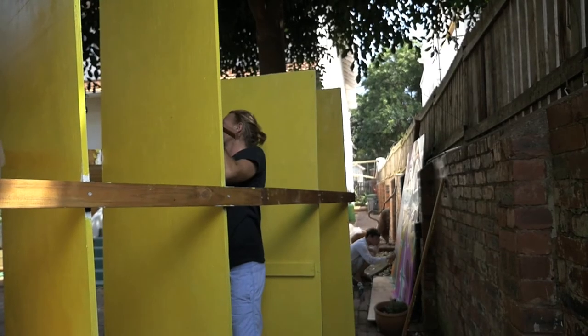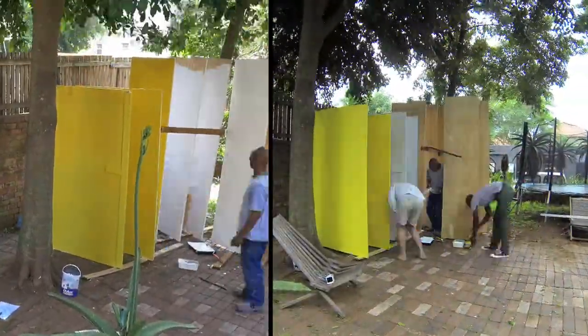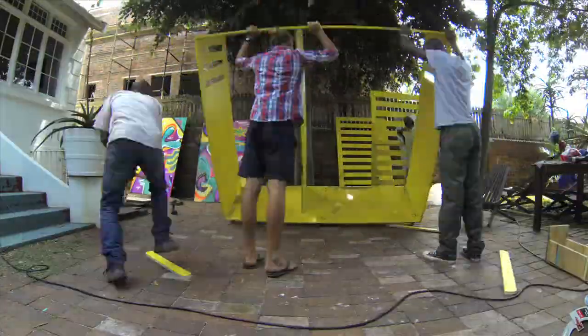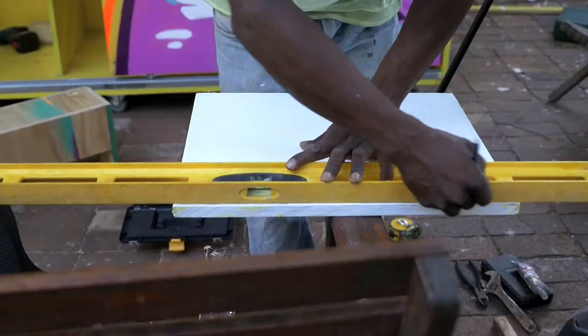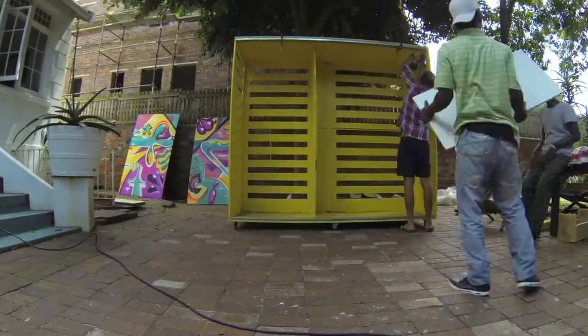The first step will be laying your shutter board down. You'll then apply your primer and then your polyurethane enamel. Once everything's cut and painted, you'll then screw it all together — just make sure everything is nice and square and flush.